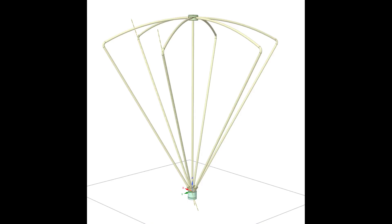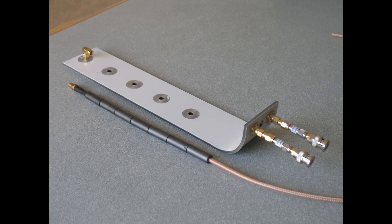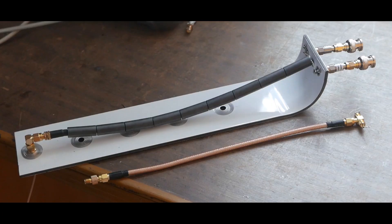In this video I'm going to show you the results of the design of a broadband balun for a biconic antenna. I'm going to show you three things: how I made a three-port vector network analyzer, a fixture that mounted the balun under test so that I could test its performance reliably and repeatably, and a balun substitute that I used to validate that the test setup was actually working correctly.